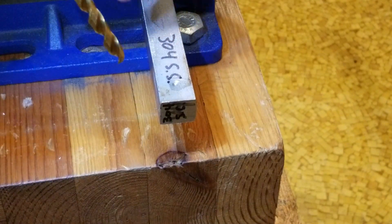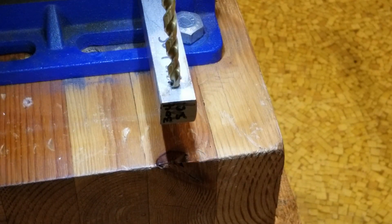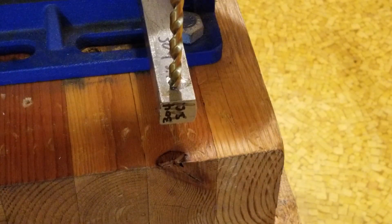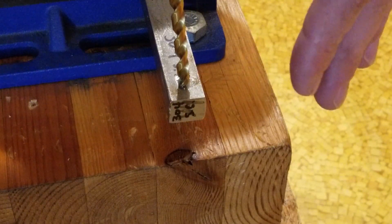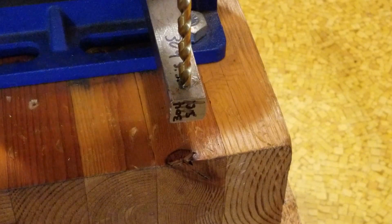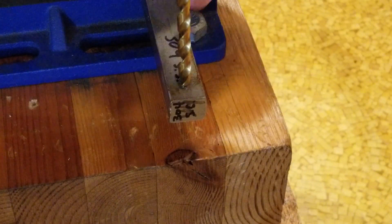We're going to do a quarter-inch hole. I did make a little divot, but just as somebody might do a normal hole through steel with a quarter inch, many times they're not going to pilot drill. We are using a DeWalt DCF887. This will be a bit loud, and we'll see how it gets through five-eighths of an inch of 304 stainless raw stock, periodically pausing to add more fluid. You do want to wear safety glasses, especially with impact driver drilling, as well as use plenty of oil.